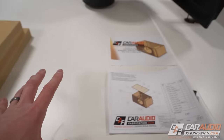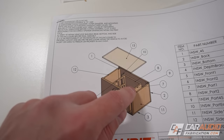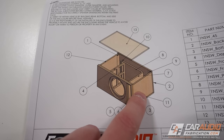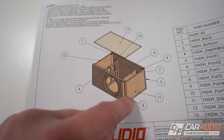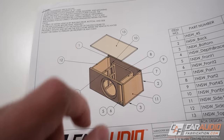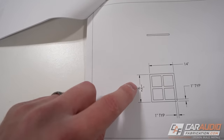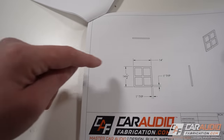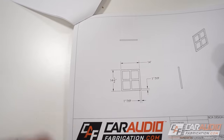Now that we have those five pieces made, I'm going to switch to cutting the two side pieces, the two port wall pieces, and the brace. All of these pieces are designed to be the same height — 14.5 inches inside of the enclosure. So I'm going to make all of those common cuts first at that 14.5 inch value, and then off of each of those long strips I'm going to cut the shorter sections.